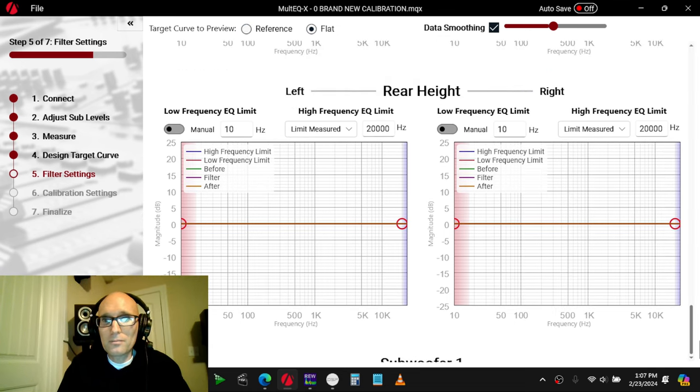Negative 10, okay, good. And we're going to send that to the receiver. So this is the equivalent of turning Odyssey off. This is exactly what I'm sending to Odyssey. But one thing interesting is that sending this to Odyssey and having Odyssey on forces everything to be in a 24-bit 48 system, which we are anyway, but you're guaranteed that now.